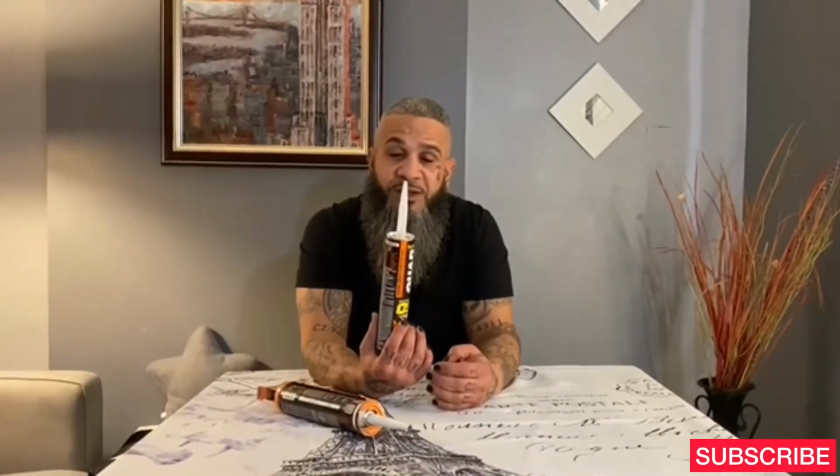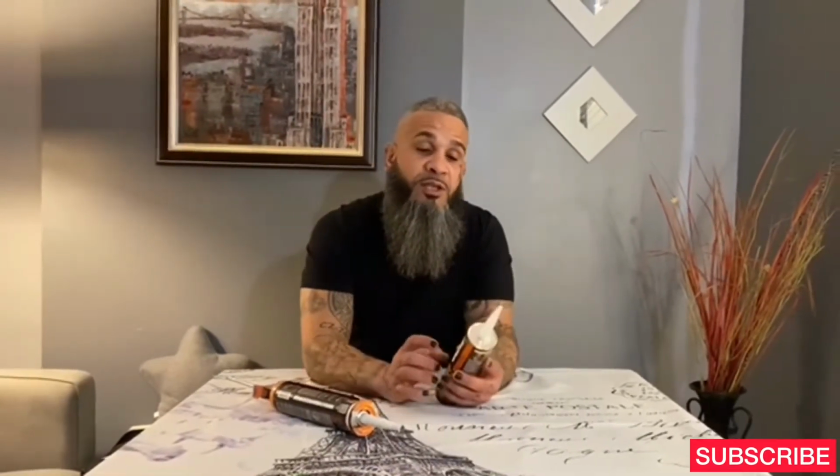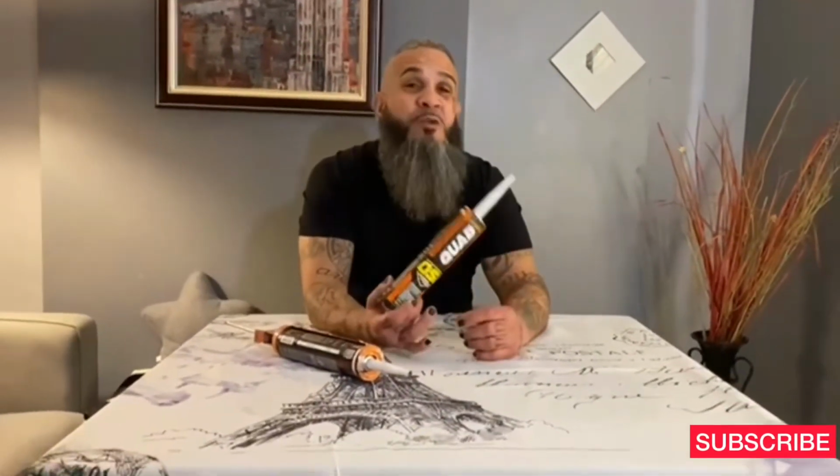They have it in all colors. This is clear, this one's white. They have it in beige, they have it in black, they have it in dark brown. But this here, you have to use paint thinner to take it off because it's an oil base. The only thing good about it is that when you use a regular water-based caulking inside of a bathroom or outside, the heat and the cold expands and contracts it. This one is expandable. It expands, but it doesn't snap like the latex caulking. So this is the caulking I recommend for anywhere in the house.